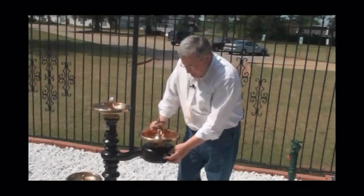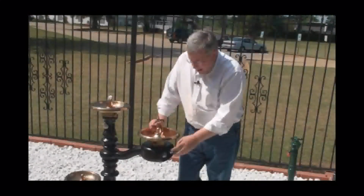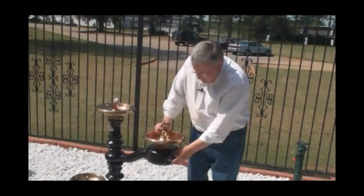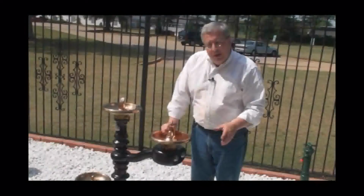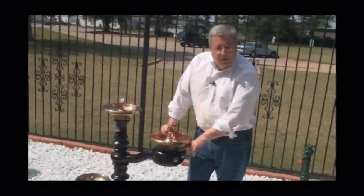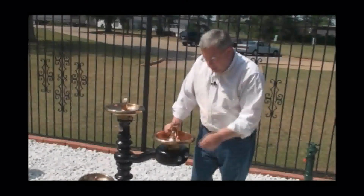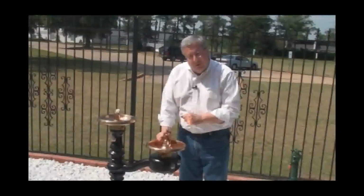And again, the good news is that's the only working component here on any of these push buttons on the drinking fountain. And what I would recommend doing, if you have a question about the lines being full of debris, simply pull the cartridges out, turn the water back on, and flush everything out very well. That way you're going to get rid of any grit, gravel, pipe dope or any Teflon tape that would come flushing out there very well. Make sure you have good streams of water, turn it off, and then reinsert the cartridge. And hopefully the cartridge should be in good shape enough to be able to do that.